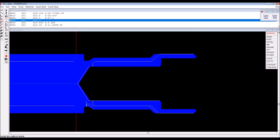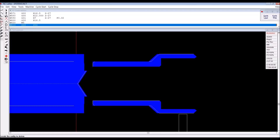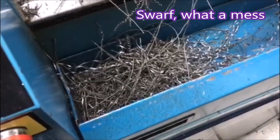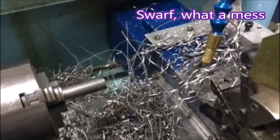The material we'll be using is S1214, which is a free cutting steel. You can see here I've got the parting tool going way in, which means that the parts actually get dropped off. They get dropped off because they're fairly light — they don't bounce around and do too much damage to themselves, so I don't have to knock them off after parting.